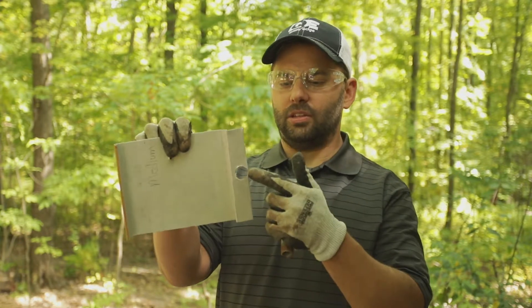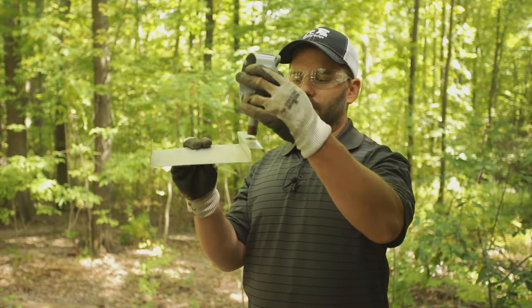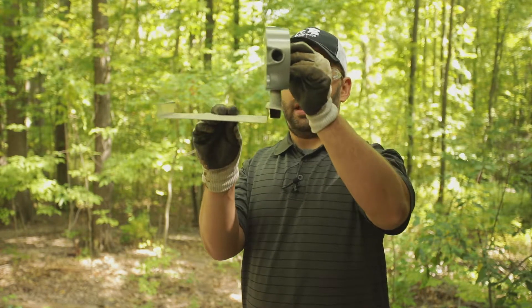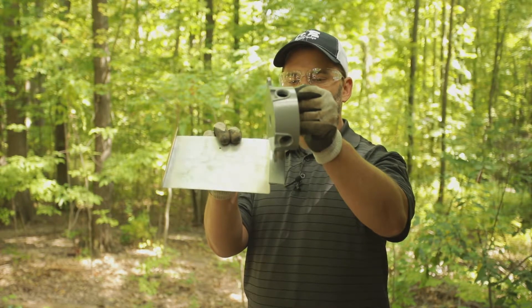I've drilled a 7/8 inch hole to fit 3/4 inch conduit right here. This would be attached to a joist. The conduit just comes down right this way all the way to the fixtures hanging on the joist where my hand is, and all you need to seal is that small opening where the conduit is coming through the panel.